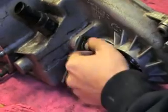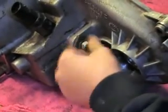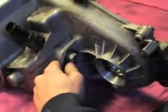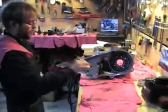Simple washer — actually backwards, there we go. And we put this nut on. I'm not going to tighten this nut down fully, just in case I have to adjust things when reinstalling the case in the car. So that's good enough for now. If you come over to the front side of the case and pull or push on this piece, you can see it moves — and that's what changes your gears, just like that. Probably squirt a little ATF on there to lubricate it so we don't scar the pieces. But that's it — move on to the next step.